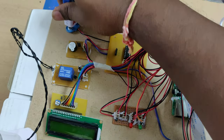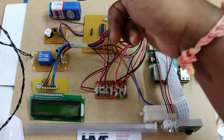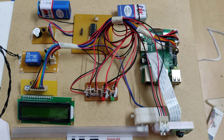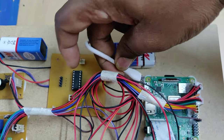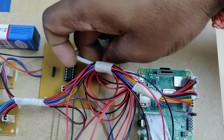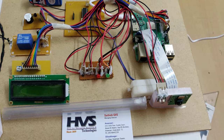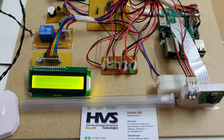Before switching on the kit, the first step is to connect the 9-volt battery to the connector as shown. Note that batteries cannot be shipped, so you will need to purchase them separately in the same configuration and model. Then connect the micro-B type connector at the slot gently, as it is an open-type connection — press it in carefully.